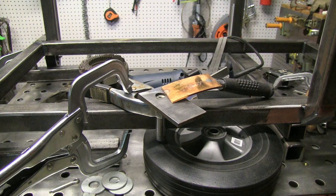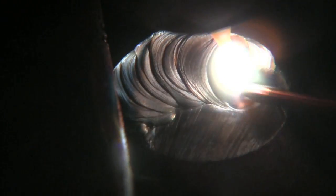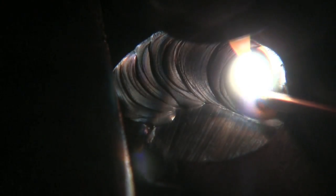I'm going to show you an example of a couple little jobs I did recently that really apply, and that's using a piece of copper like this welding spoon here. I'm doing a little plug weld — welding a five-eighths piece of round stock that's going to be an axle for the wheels on the welding cart. I'm doing several layers to fill it all the way in, so I put the copper right next to it, hold the arc there for a minute, maintain shielding, and whip out — it works really nice.